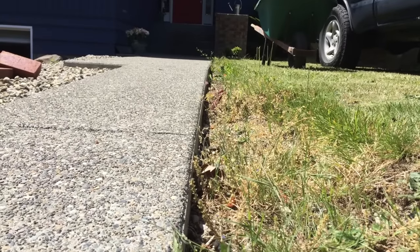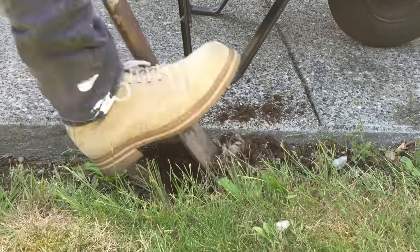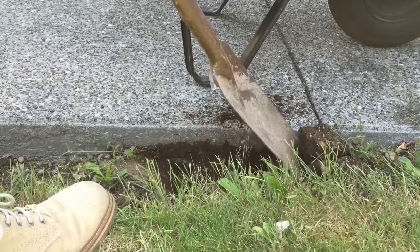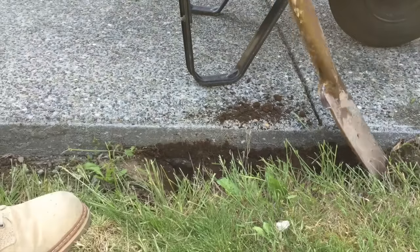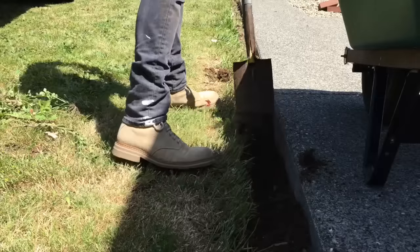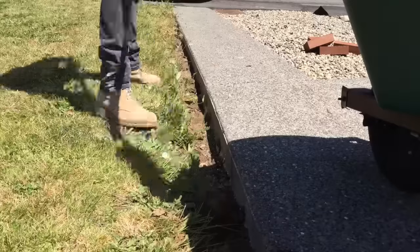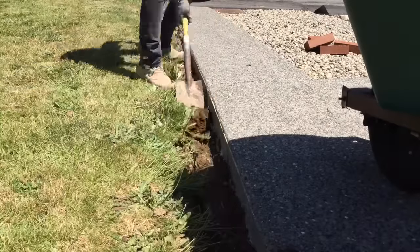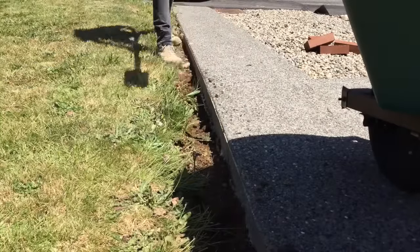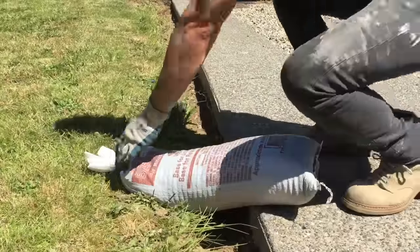As you can see, it's a bit overgrown on the side of the walkway, so I'm going to take my trusty shovel and do a bit of excavation. For this project I'm using my narrow 6-inch wide shovel, which works perfectly in this type of application. Feel free to smooth out the area and stomp it down after excavating to make sure the soil is fully compacted. Just remember, you only have to excavate a couple inches greater than the brick itself.